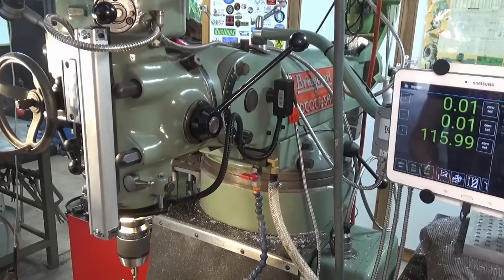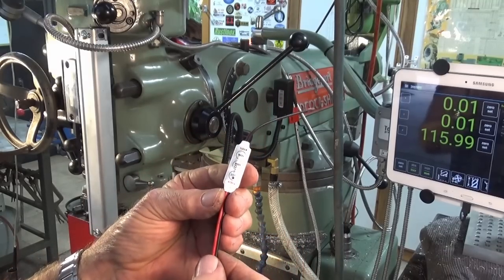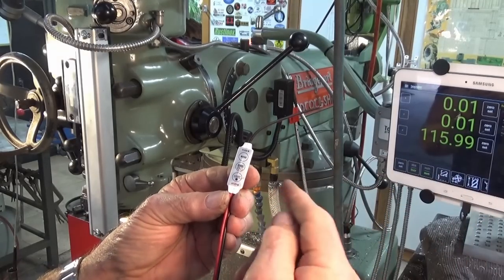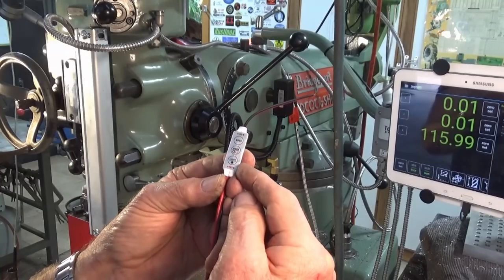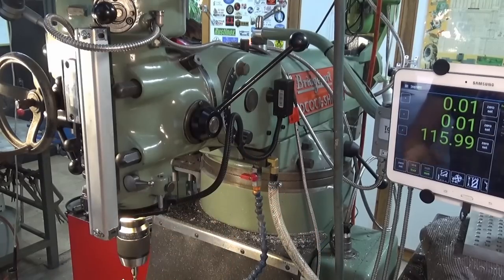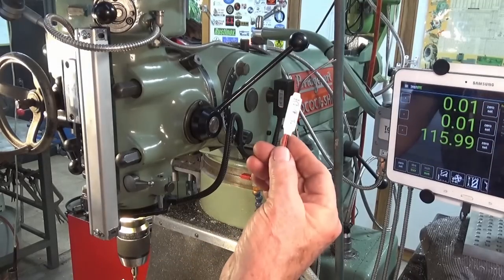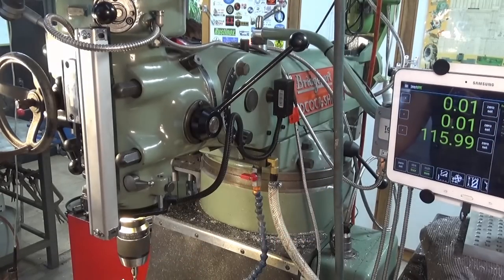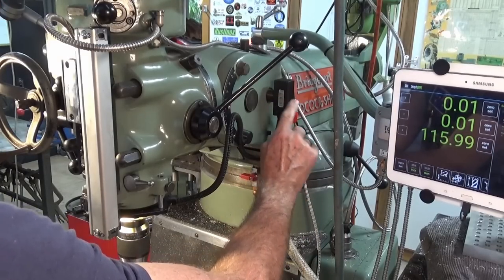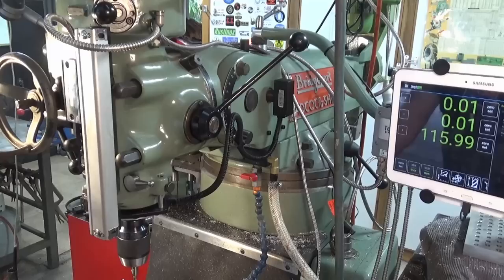And to control it, I bought one of these. Now, these are sold as a controller for LED light strips, and when I checked, they say they're okay for SMD, that's surface mounted device type LEDs. And I don't know why it makes a difference if we're using COB LEDs, but it turns out that the controller that I've got in this 3D printed housing here has failed. So I bought three of these, and this is the last one I've got left. The other two have failed, and it's getting quite hot. And when you press on that middle button, it should actually turn the light off, but it doesn't. It just stays on, and it's getting really hot. So that one's failed. I'm going to have to rethink that.